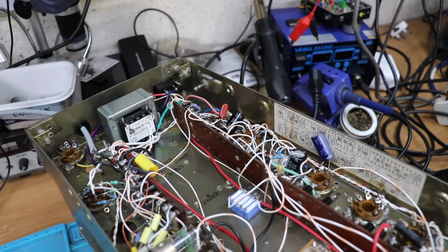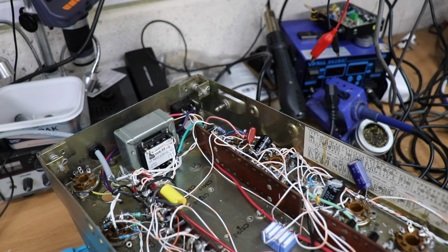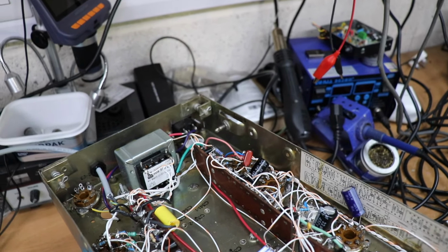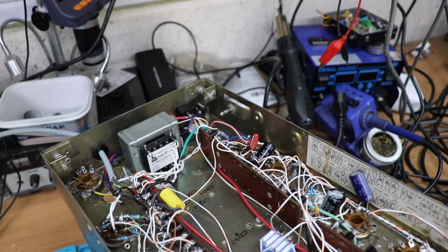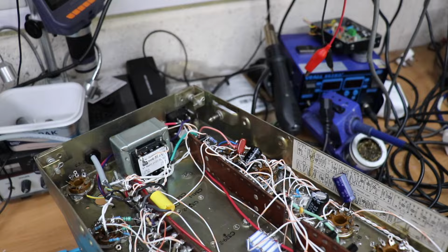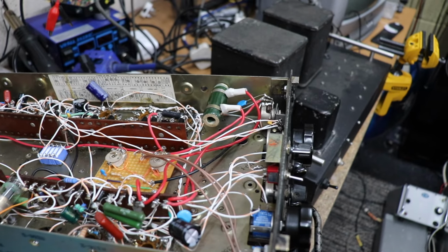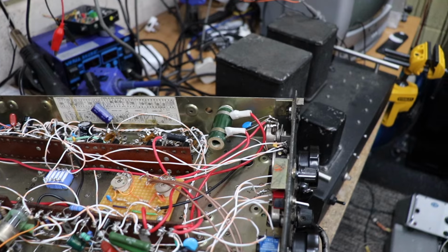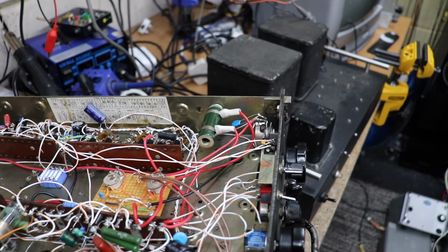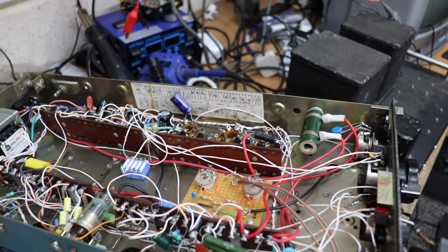At the back, there's a separate 6-volt transformer for the CRT tube, which, despite being a bog standard one, seems to be reasonably okay, considering that it's got something like minus 1500 or 1200 volts on it, because the heater and the cathode are connected together, so obviously they've got quite a lot of minus voltage on there, but it doesn't seem to mind. I haven't had any problems with that. They've got a bleeder resistor there, a dropping resistor, because the voltage coming into this from the external power supply for the HT for the deflection plates is quite high, so I've had to use that just to drop it down a bit to 400 volts, which that resistor gets quite warm, but it does seem to work.